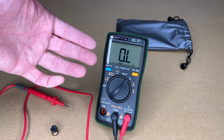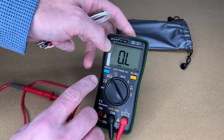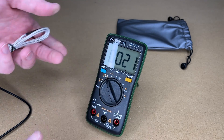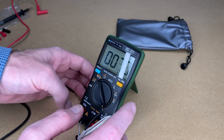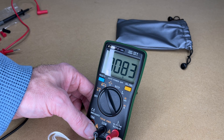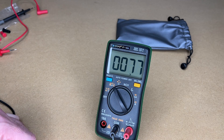So that's a nice feature — it supports all the traditional multimeter functions but also measures inductance. It also comes with a temperature probe. Switching to temperature mode, we have both Celsius and Fahrenheit options. The little probe reads 70°F currently; putting my fingers on it you can see it rises pretty quickly. You could use that temperature probe for things like air conditioning systems.